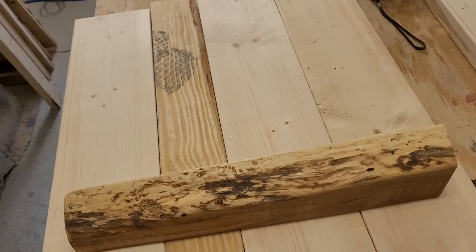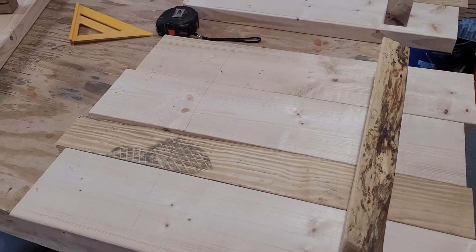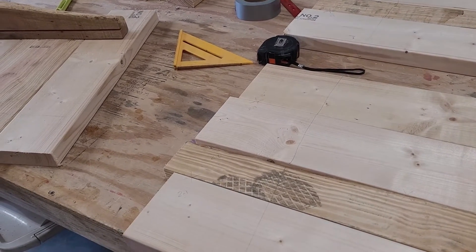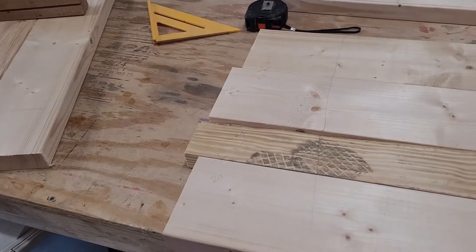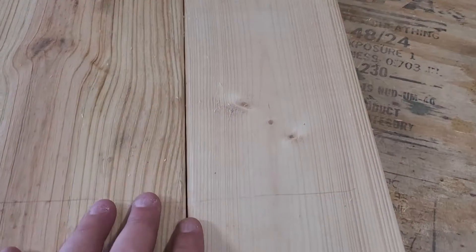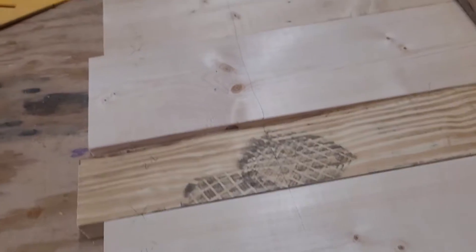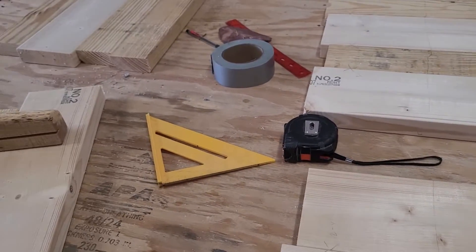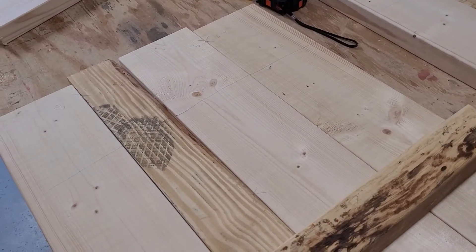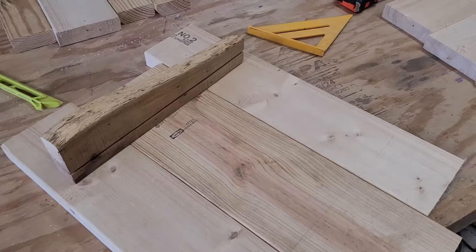These will have a little bit of weight to them — nothing horrible, but more than you want to hang on just drywall. So I'll put those keyhole slots at 16 inches on center to hit common studs. Plan to do pocket hole screws along with glue on the back side. I've got everything cut down to length and I'll run it through my table saw to get rid of maybe a quarter inch off the sides of each board. Then a lot of sanding, and I'll break out my tablet to get some Cricut work going and figure out what kind of designs I want to do, then finish up with poly. Stay tuned.